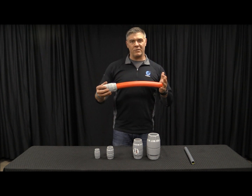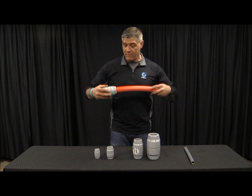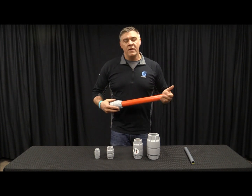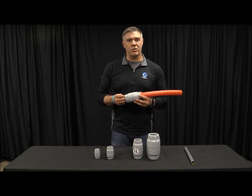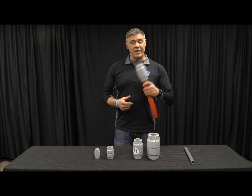But you haven't successfully put the duct into the coupler yet — you need to push it a little bit more. You just give it another push and you see it drops in just a little bit more. The reason why is although you've hit the bite ring, you haven't gone through the rubber seal. And that is what holds all your air pressure in and keeps the water out. So let's take it apart and take a look.